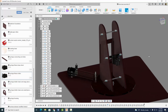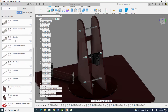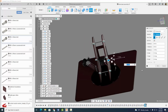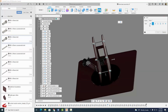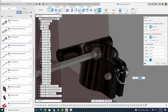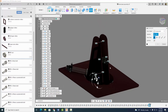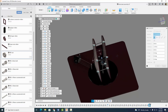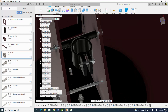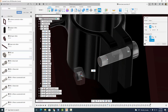So the next thing we want to do now is to go ahead and add a little M3 bolt through here. So we're going to come on up to M3 by 12 millimeter bolt and insert into current design. I'm going to do a rigid joint. I know that this circle right here corresponds with that circle right there. Then let's go ahead and put a nut on the other end. Go to assemble joint, do a rigid joint again — most of it's going to be rigid joints for this, and the nice thing is rigid joints are easy.